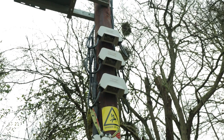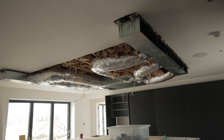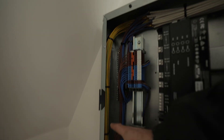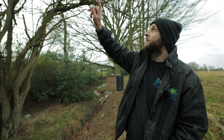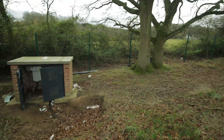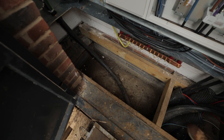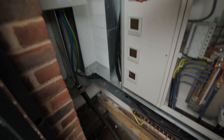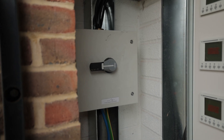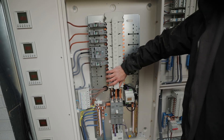As you can see we've got our three fuses hanging down here which UK Power Networks have left. We're not quite finished over at the house yet with the electrical stuff, so at the point when we're ready they'll just come along, pop these in, and we should have power. This is why that cable is so big — because our electrical room is all the way over there. Here we've got the other end of that 150mm five-core that comes up into another isolator, so from 150mm we can now go back into the 70mm which feeds this nice big panel board.